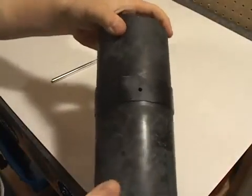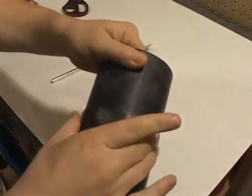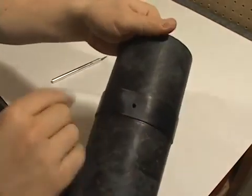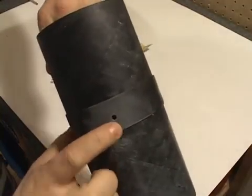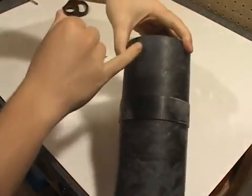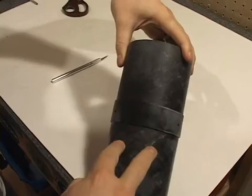The switch band has now been glued in place — I couldn't really show the filming of that; I don't have enough hands. Once the switch band was glued in place with regular West Systems epoxy, I cleaned up the epoxy on the top as well as the bottom. I drilled three 3/16-inch wide holes to vent out the bay, and I believe the switches are going to end up being put below the switch band, which is not ideal, but it'll still have enough room.